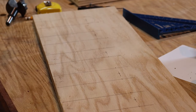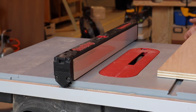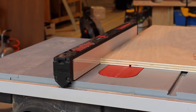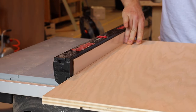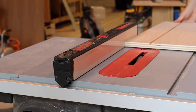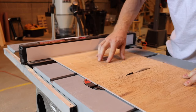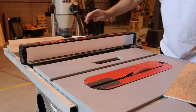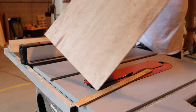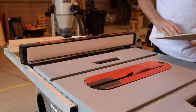Before drilling those holes, we wanted to take care of a couple last cuts starting with the dado stack, then stow the table saw for the day. This is a quarter-inch wide, quarter-inch deep dado that's going to hold a small shelf underneath for screw boxes and drill bits — measurements are on the plans. I had some quarter-inch walnut ply laying around from my scotch cabinet build, and that'll do just fine for those sliding shelves. Remember, this is a scrap project, so the fact that it has walnut accents is not only quite frankly sexy, but practical.